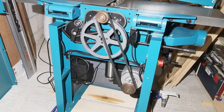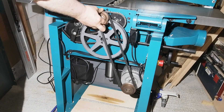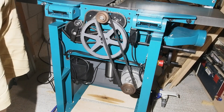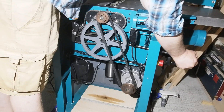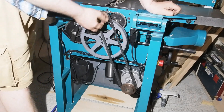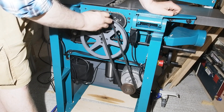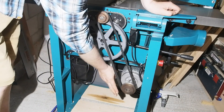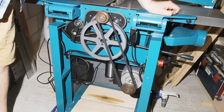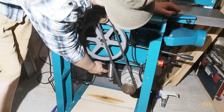I've taken the cover off the back of the machine so you can have a look inside — easy to do with just three screws on each side. It uses a standard V-belt for drive. The feed rollers are driven by a large reducing flywheel type thing; if I engage it you can see it makes contact with the shaft of the cutter block — simple but effective. Interesting to note that although this is a 16-amp machine, the blurb on the motor rates it at 9.5 amps. I guess it may peak a little higher on startup or under high load.